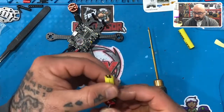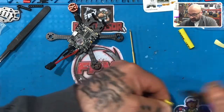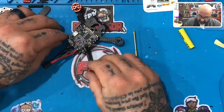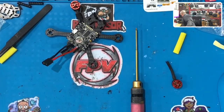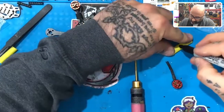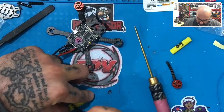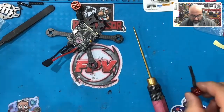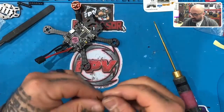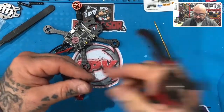And what I'll do is I usually will save these heat shrinks, okay, because I know I'm going to need them again. So the best thing to do, see how that is. Yeah, it should be good. Best thing to do is to, like, let me see if I have something here. Yeah, so I'll take my permanent marker, right, and I'll just come over on this one and put 35. And then I'll come over here and I'll do 30. And these will be good for any size motor, so just save them. I mean, they'll be great to use down the road. So let's go ahead and tin this one up and just make sure that this fits like I'm hoping. And then after that, you guys can finish the rest here.